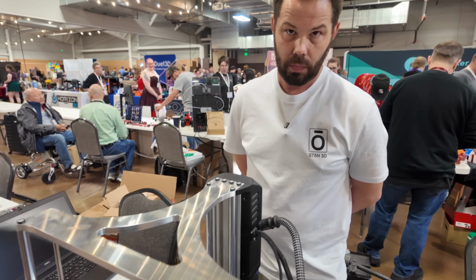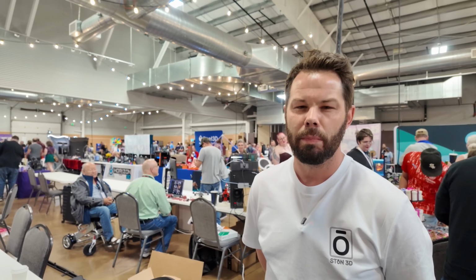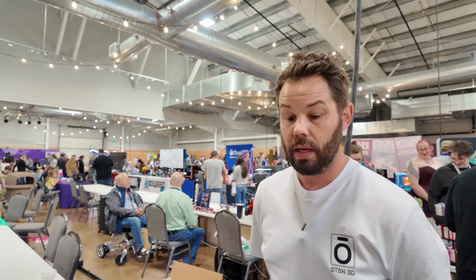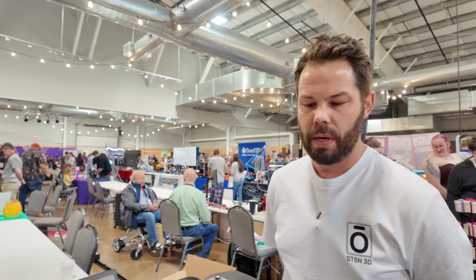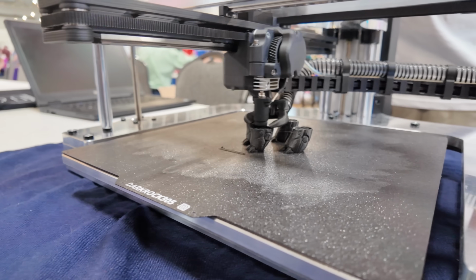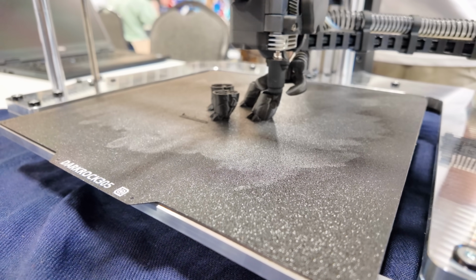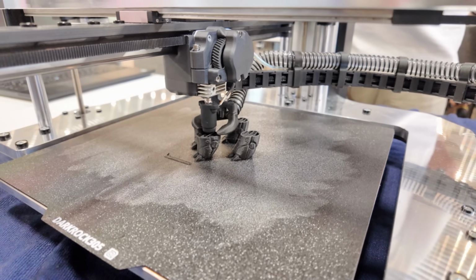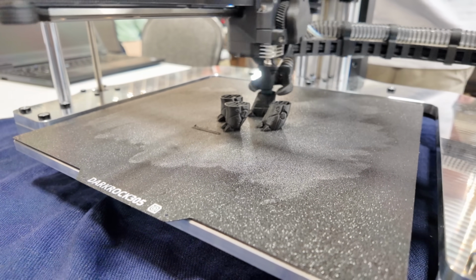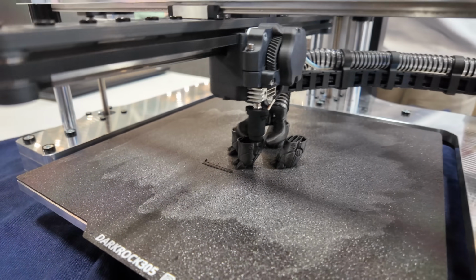What are you using for gears? Are you using off-the-shelf gears from another company or custom? No, absolutely. This is a RepRap machine. As you may or may not know, I did make the extruder, so I have some history in that area. This has an extruder drive gear, but I did thin it down, lighten it up, do some speed holes. And it being a RepRap machine, it was very important for me to be able to print those gears and still get the highest print quality. If you need specialized machining and millions of dollars to produce high quality gears, then it's very hard to scale that and be a RepRap project. So these are printed gears. It's nylon, made in USA, and I'm very happy with them.